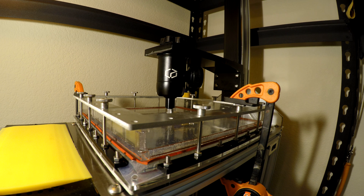This is the PR48 resin. I'm using some pretty gigantic lifts here — the same lifts I used when I originally printed calibration parts. I'm going to use the same settings, which means you're going to see this humongous 7mm lift, which we probably won't need. It's virtually impossible to have a true 7mm lift because this system is so rigid.